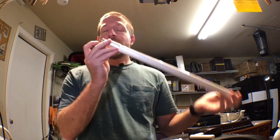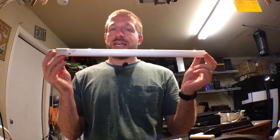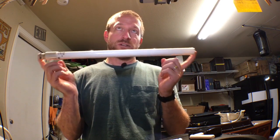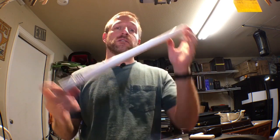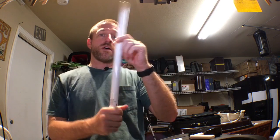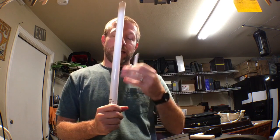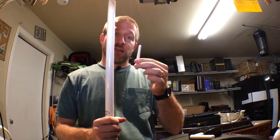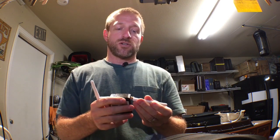This has an N connector on the bottom, and you can convert from SMA to N very easily. This has 10 dB of gain — 9.7 — and this will receive and put out a lot more signal, radiating like a donut around this antenna. It doesn't radiate up; you don't point it where you want it to go, it radiates outward. Because there's so much more metal in this antenna, it does a much better job radiating outward. It has multiple stages of the same wavelength, so you compound the strength of your signal in a certain area.